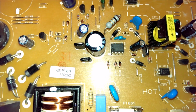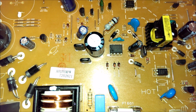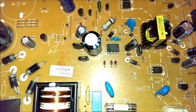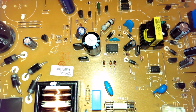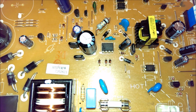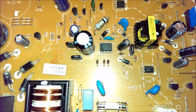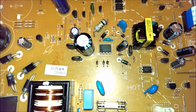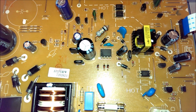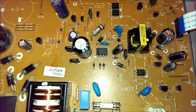Luckily for me, the MIP2F3 integrated SMPS IC is okay. They're a bit hard to get in the United States due to an agreement between Panasonic and Power Integrations. These are only sold to Japanese companies, which I'm assuming Funai is one of. So you can't easily get them. You can get them, they're just technically not supposed to ship them here. I found a source that had 3 of them. So I guess they're allowing small quantities in, or somebody's getting small quantities in for the purposes of repair.